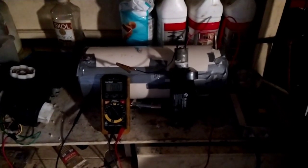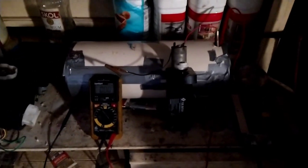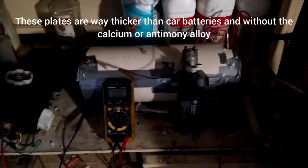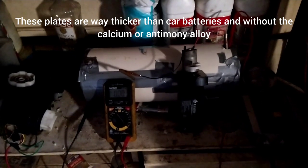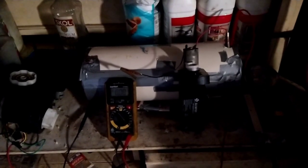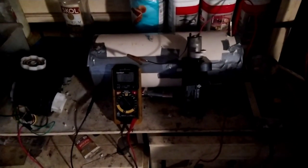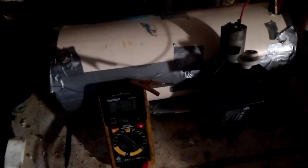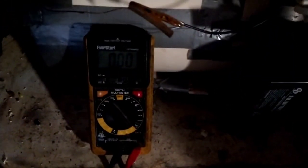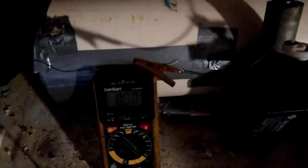I've already given this its current charge. This is my second load test — that's a small DC motor running a pump. I have about 13 plates, same as the other one. They have little microscopic fiberglass compressed into a mat — a thick mat. I'm just using thick paper towels and a layer of regular fiberglass sheets. It holds the sulfuric acid, and this thing has been running for about an hour and a half maintaining about 6.36 volts.